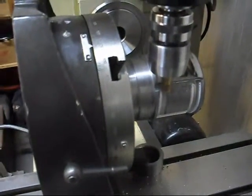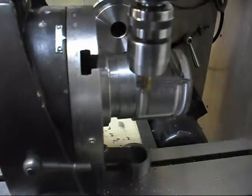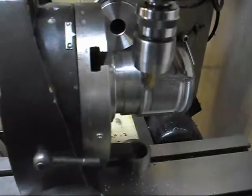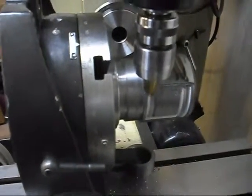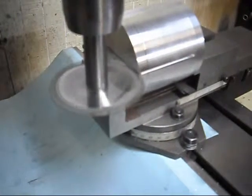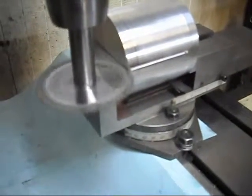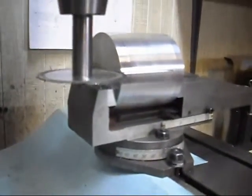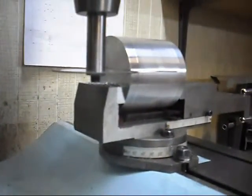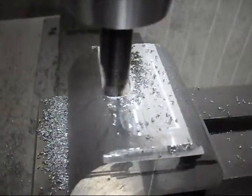We've just got to machine from flange to flange here — you'll see what the finished product looks like. We need the rotary table to be able to machine this the way I want it. We took a block of aluminum and cut it down to the size of the hook, kind of pre-drawn out a little bit for what we needed for a shifter block. This is the beginning of building our actual shifter block to accommodate the shifter forks we're going to use on this project.